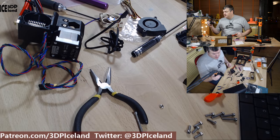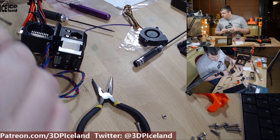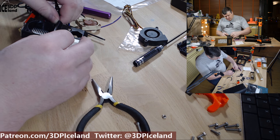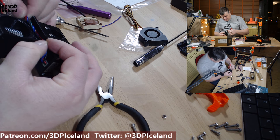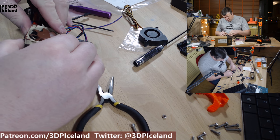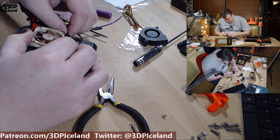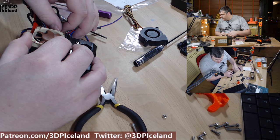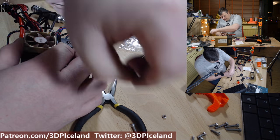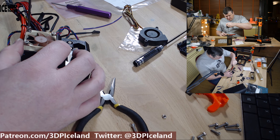The next step is step 20 to prepare the cooling fans. The Noctua fan is a hotend cooling fan. Before you mount it you have to prepare the cable for the extruder motor - it has to go inside the groove here so the fan will keep it in place. Then take the fan and push it against the cable. The label on the fan must be facing downwards away from you. Use four 18mm screws - those screws just go into the plastic so make sure you don't over-tighten.